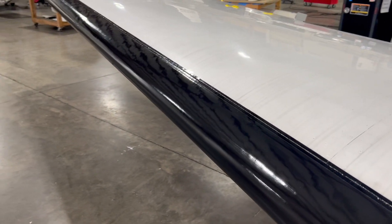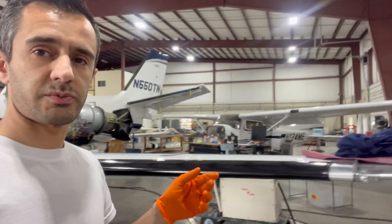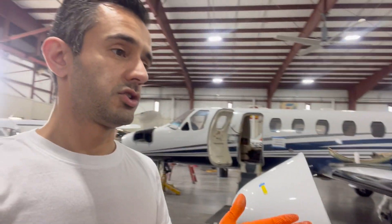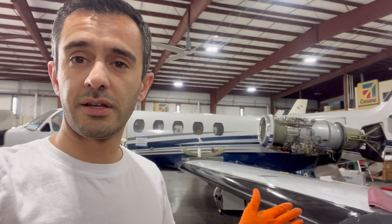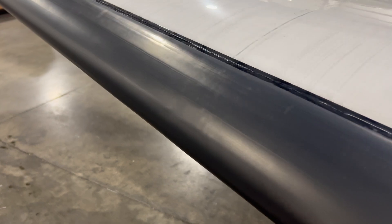Once this fully dries it'll get a little bit shinier and it looks pretty good. To recap: first we wash the boots to get bugs off — for turbo prop also get the exhaust off. Then we use the prep solution to dissolve any old sealant and loosen up oxidized rubber. We rinse until the towel comes off not showing a lot of black transfer. Then we did three coats of sealant, alternating the direction each pass. Don't overdo it — this is not the time to put seven coats on. It'll probably look really good but it's not good for the plane. Hope this helped demystify the process — thanks for watching, make sure to subscribe.